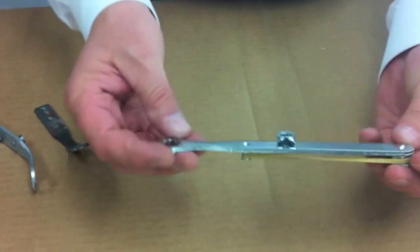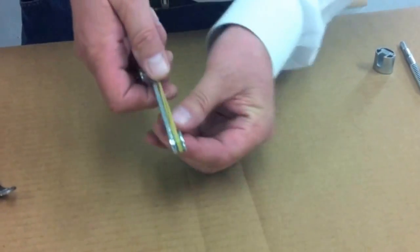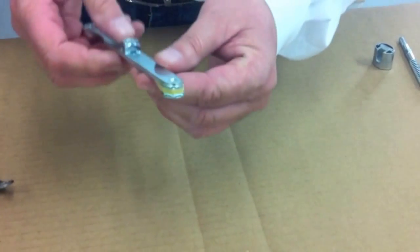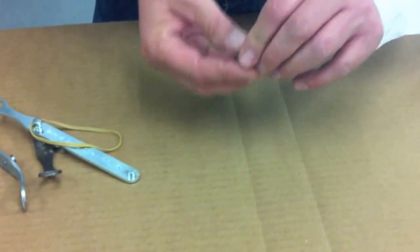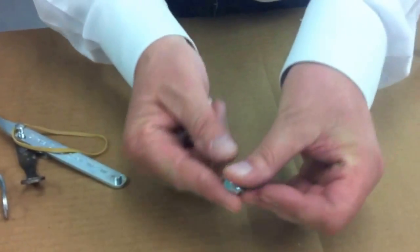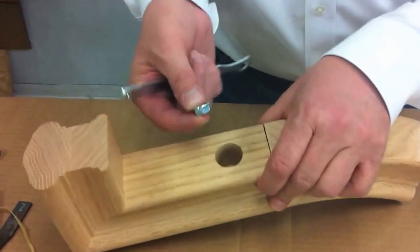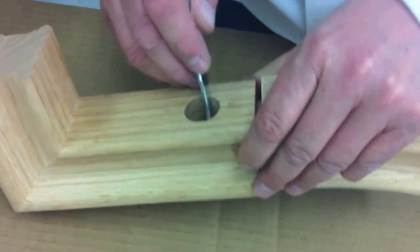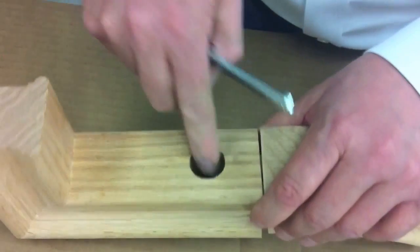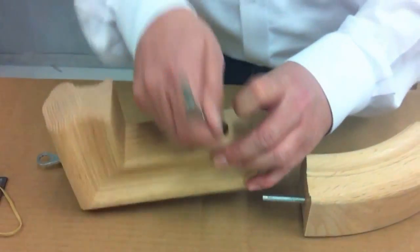Here's how one of those brand new wrenches works, where you have an elastic band that you stick the nut inside the hole and start it using this band. It works, but as a stair builder, all of these things are very cumbersome and time consuming. You can put a little bit of glue on the tip of your finger and stick that nut in there and get it going too. It's a very tight one-inch hole, so trying to get that nut inside there and only taking very short turns with the wrench to tighten up is time consuming and frustrating if you cross-thread that little piece. It can be horrible trying to get the job done.